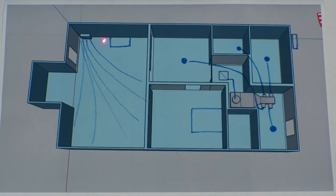The low floor unit really blended in well with the room — it's nice and hidden next to the couch, and the air is blowing the direction we want it. One of the biggest things we had to think about is where the client is going to be spending the majority of their time, and the answer is typically the couch. We've got adjustable louvers on this system — we're not going to have direct air blowing on the human body, which is something we always want to avoid with a ductless if we can help it. In cooling mode, you'll feel like you're in a freezer pretty quick if that cold air is blowing right on you. We were able to avoid all that and get away with just one single ductless in this room.